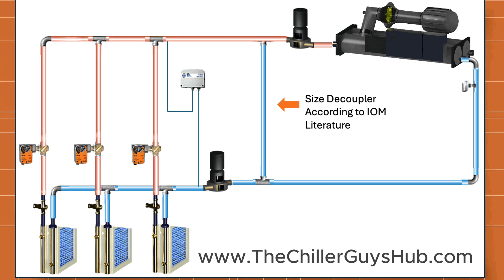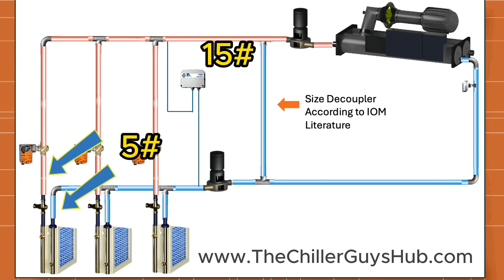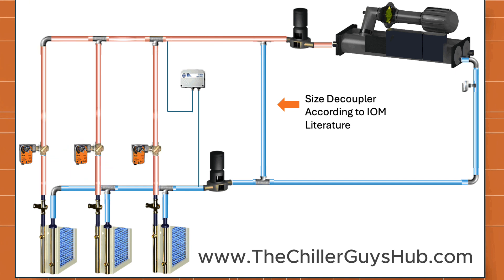When finding your set point, set a rough initial value, then go check your furthest air handler, measure the pressure drop on the water side, compare it to the design sheet, and verify you're meeting design flow. Your air handler might be rated for a 5 to 10 psi drop for its designed capacity, but you may need to set your pump set point at 10 to 15 psi if the pressure transducer is located right next to the pump. The automation system speeds up or slows down the secondary pump based on differential pressure.